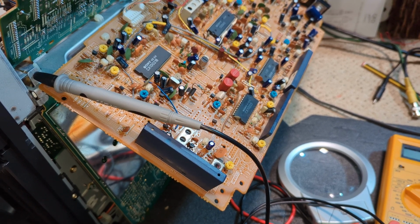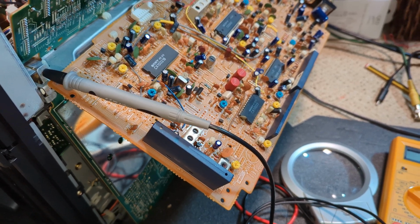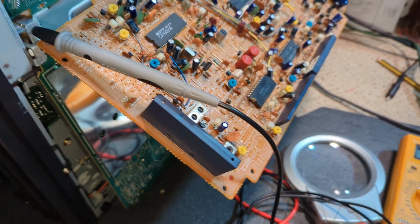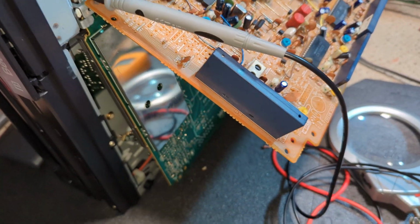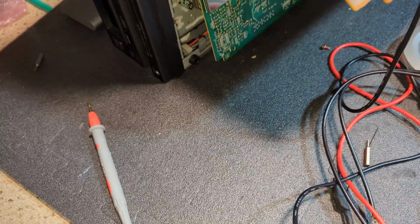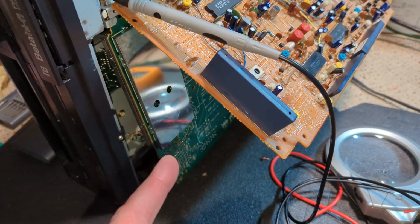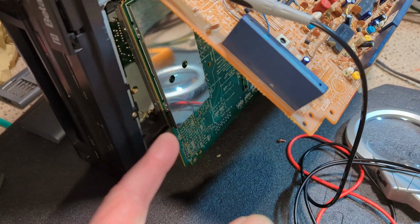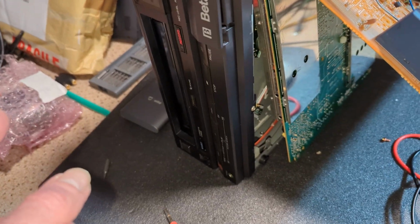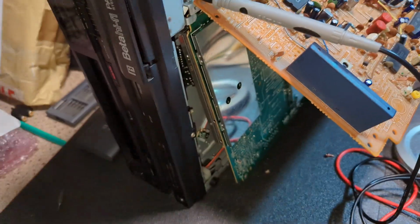But yeah, I've been slightly stalled with my testing because the head drum keeps dropping out. So what I did, when it wasn't working, I put this head drum in. It's from an F30, I think, and obviously it doesn't run at the right speed, but it will start. Every time I've put that one on, I swap it over and the other one works, the one that's in here works, except for one time.